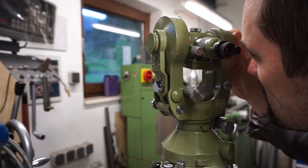That's reading four Gon decimal positions, which is roughly half an arc second. And tell me, if this is not elegant to read, then what is? And keep in mind, this is a purely mechanical instrument.